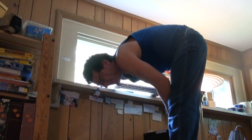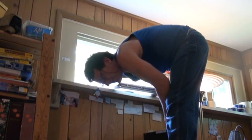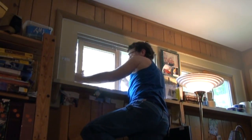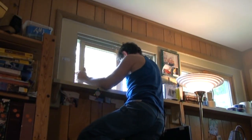So once again, I'm quickly reviewing the instruction sheet. There's diagrams as to orient the shoes, the guide shoes, and the outside sash, the passive sash, and the inside sash, the active sash. The guide shoes are in directly opposing positions. So on the outside glass, you want those little shoe catches to the outside of the pane so they fit correctly in the tracks. And then when you do the inside glass, the guide shoes and the little guide catch are exactly the opposite position, 180 degrees rotated to the inside.